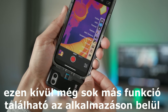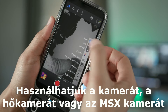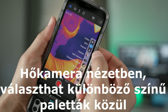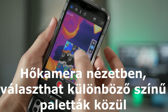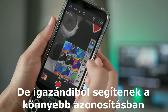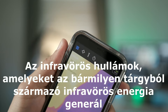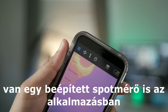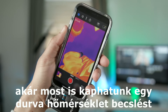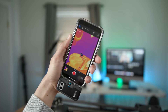There are many more features found within this app, which hasn't been upgraded for the iPhone X yet. You have the visible camera, and you can switch between that and the thermal camera, or use the MSX camera, which is a composite of both the visible and thermal cameras to provide a better, more discernible image. You can also choose between different color palettes — these aren't just for looks, they actually help you identify certain waveforms generated by the infrared energy emanating from objects in your environment. There's also a built-in spot meter so you can pinpoint locations in the viewfinder and get a rough temperature estimate, though accuracy depends on how close or far you are from the objects.